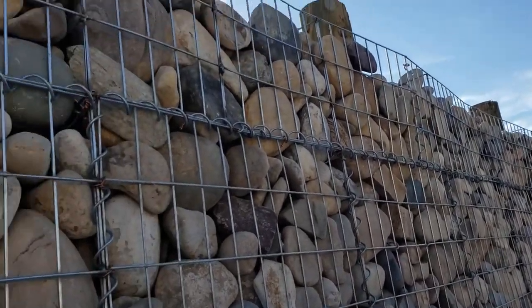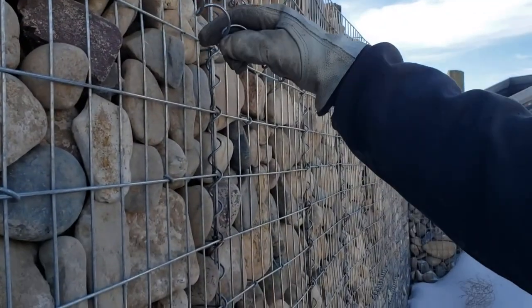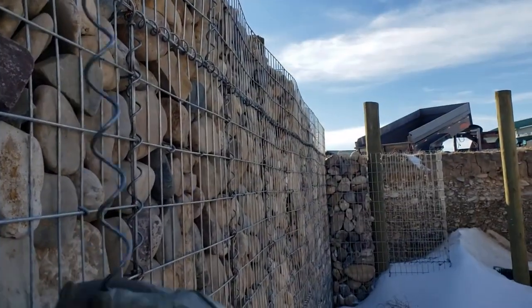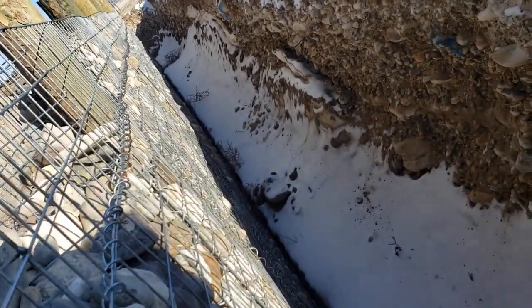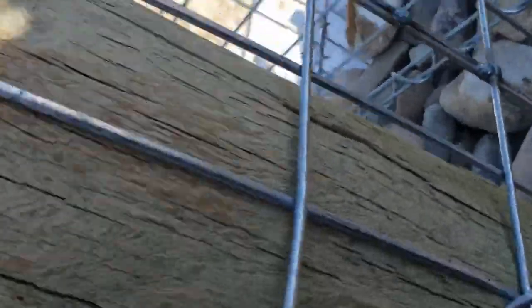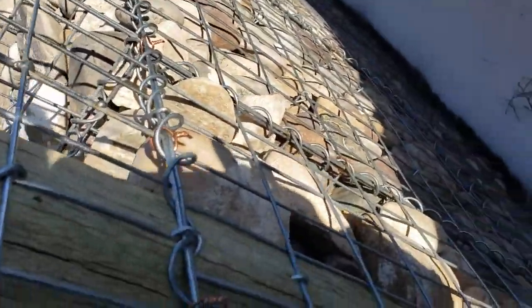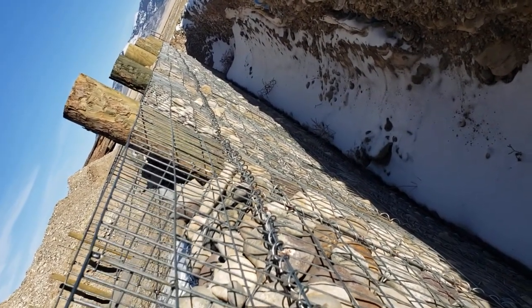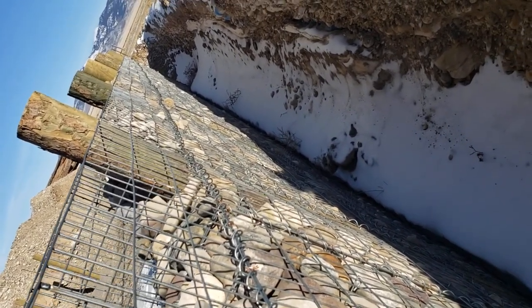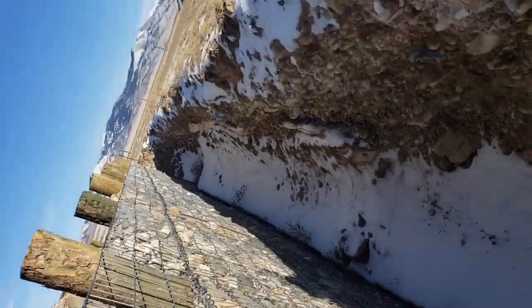You can see light through the wall on that back side. That is where we're going to be placing the pond liner and four inches of insulation, and then another layer of our filter cloth — that white canvas — that will help seal that back side before we backfill against it. Looking down the back side of this Gabion basket wall, you'll see a lot of snow drifts. You'll see that we stapled each of the cages to these posts all the way down to secure the back side of the cage. Against this side we'll have the pond liner, then the four inches of insulation, and then the canvas — that's the hydrostatic barrier and also your moisture barrier before we actually backfill the hole.